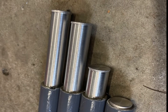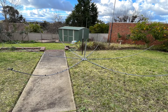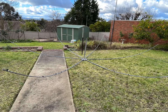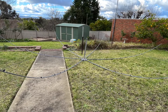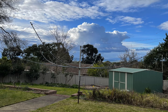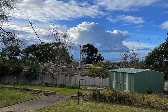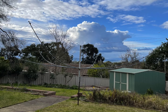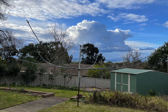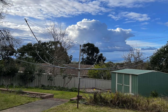Here the pins are inserted into the ends of the poles. The first test assembly is on the ground, of course, to make it easy — that's just the arms tied into the center. Once that was done, I installed the 20-meter wire just to test one band, put it up on a slight elevation in the backyard, and ran a feed line into the shack for a little test. I was able to contact a station with that setup, so I knew everything was working and the antenna was ready to be installed up on the roof.